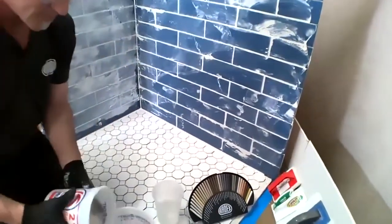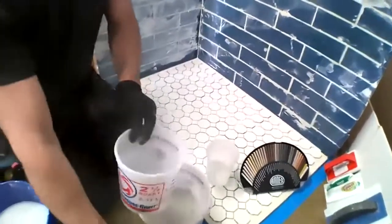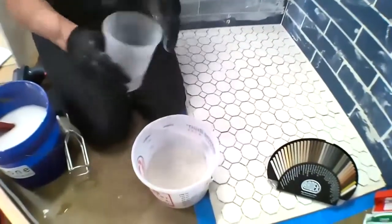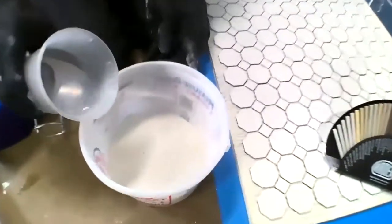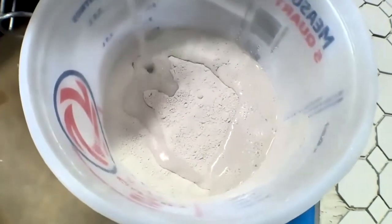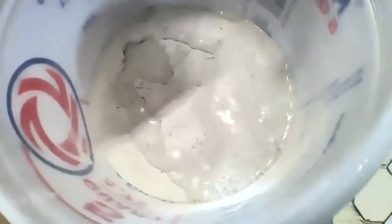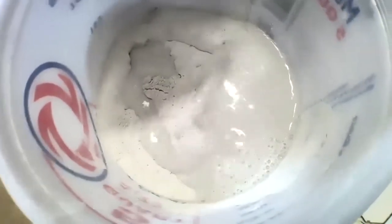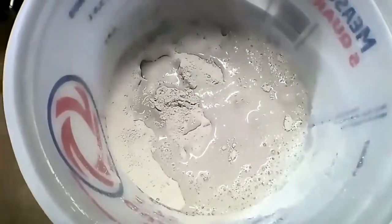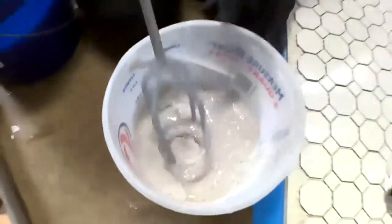So you'll notice I'm actually putting my powder in first. Typically that would be a no-no, but I want to show you a unique characteristic of the ARDEX FL grout. Do you see what that water is doing? It's not soaking in, it's actually sitting on top of the grout. So the grout itself is hydrophobic. Hydrophobic means scared of water. So now when we go to mix it,